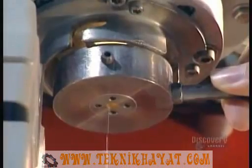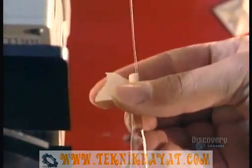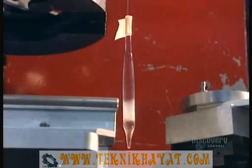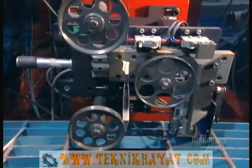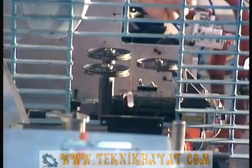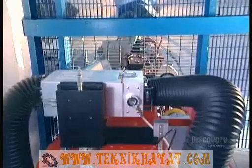The drawing tower's oven heats one end of the preform to 2,000 degrees Celsius. Then, using a glob of glass as a weight, they stretch the soft glass and keep stretching it until they've formed a thin glass fiber. A series of pulleys measures the tension on the fiber as it's being drawn. A special monitor makes sure the fiber's precisely the right diameter — 125 micrometers, about an eighth of a millimeter thick.